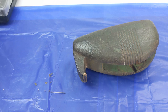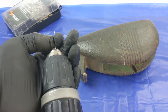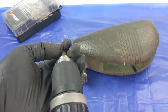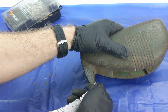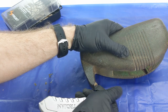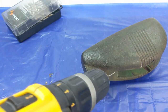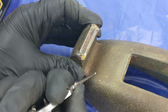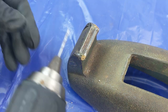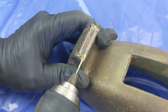With something like this, I want to avoid damaging the cast iron so I'll start off with a small drill bit and try to pull out the little bits of wood around that. If that doesn't work, I'll move up to the next drill bit and repeat the process. I'm using my Stanley knife to make a small divot for the drill to sit in — this should help find the centre and avoid hitting anything while drilling. The smaller hole is referred to as a pilot hole; just like a pilot guiding a plane, a pilot hole helps larger drill bits follow the same path. It just makes life a little bit easier because those bigger drill bits do tend to wander.